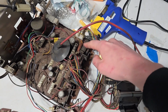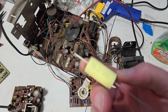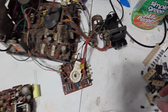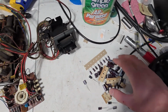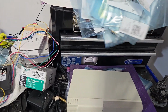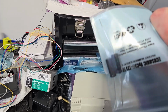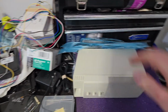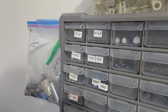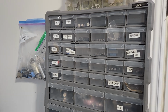This is a filter cap for G2 voltage, and that's pretty high voltage. So we got this for this. This is separate from the cap kit. This should be included with the cap kit, really. But anyway, I'm going to organize this. I have all these spare capacitors from a previous monitor adventure. I bought a whole bunch of extra ones just to have some in stock, and then I'll pull some from all this. Hopefully I can find enough of the right capacitors for this job.